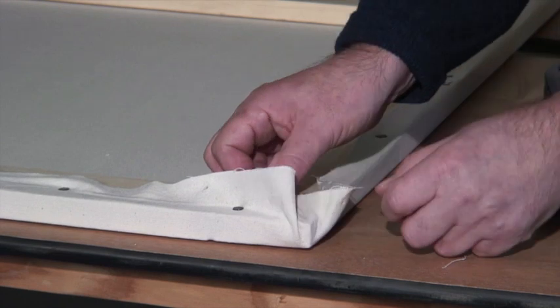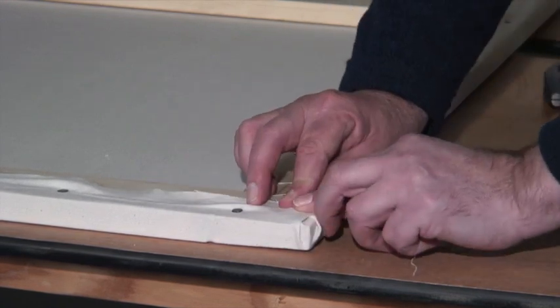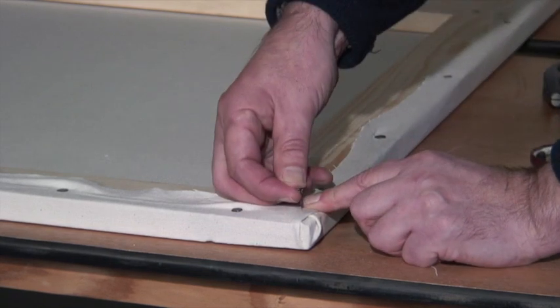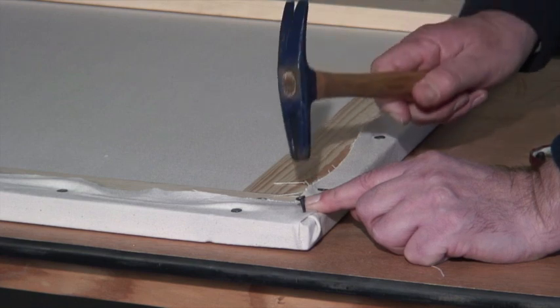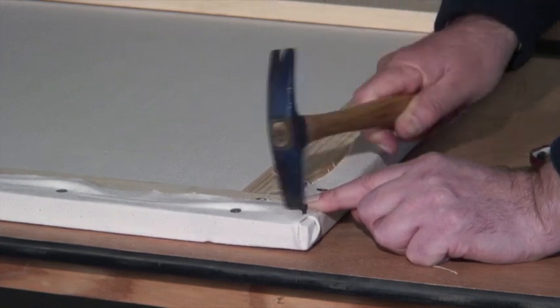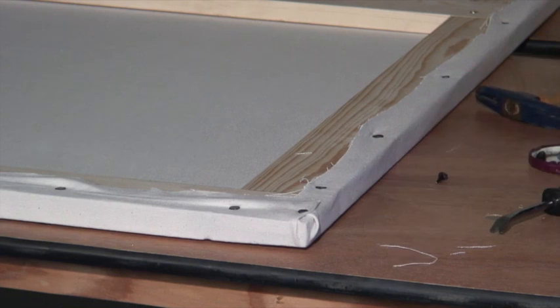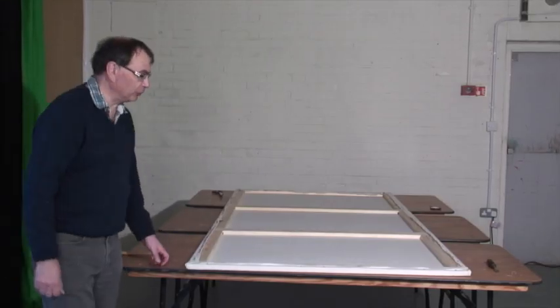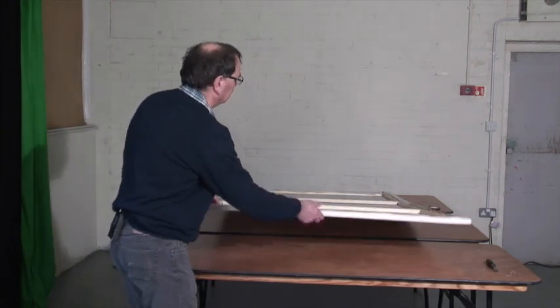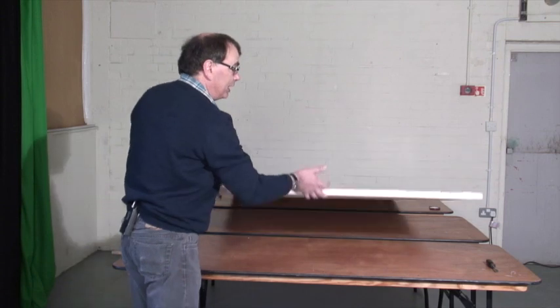Having got it roughly in place, you now go round and put nails all the way round, then we come to the corners. You fold in one side like that, like that, like that, and put your nail just there to hold it. And that's how to do a corner. So we've done all the corners — that's not bad, nice and tight, nice and flat.